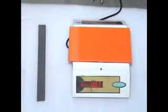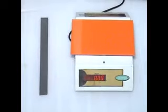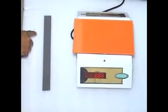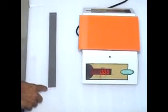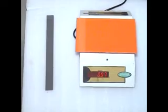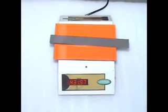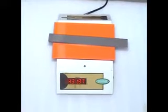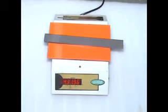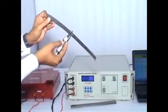First of all, cut the strips. Strips should be approximately 500 grams. All strips should have the same length and same width, with dimensions of 305 mm length and 30 mm width. You should ensure that all strips have the same length and same width. Now weigh the strips using a weighing scale — it should have 10 mg accuracy. Weigh strips in multiples of 4; minimum 250 grams and maximum 500 grams weight is required. Measure the thickness of the material using a micrometer screw.